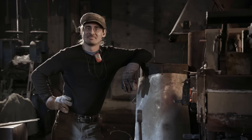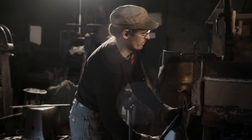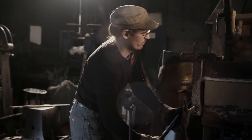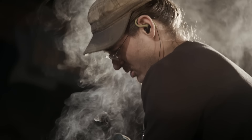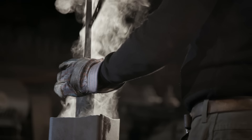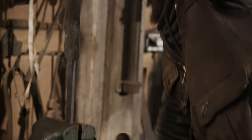The blade is now ready for the heat treating process. Ilya's going to place the blade into the long heat treating furnace, adjusting the propane and air carefully to make sure the blade is heated evenly. Once he's satisfied with that temperature, he's going to remove the blade and quench it in oil. We then move straight to the vise — we have a few seconds to play around to get it as straight as possible, then clamp it in the vise and leave it to cool slowly.